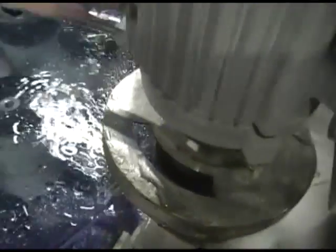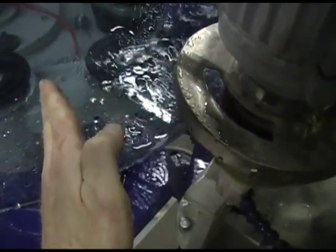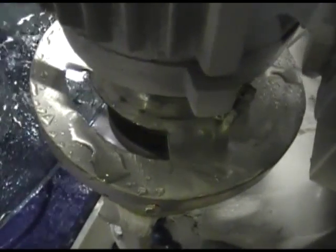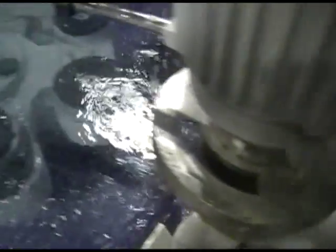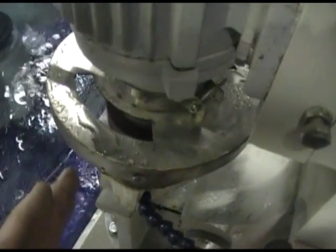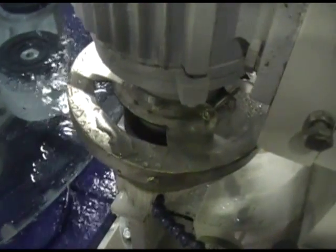Now, the head should be 90 degrees — it should always be grinding and polishing 90 degrees to the edge. You can see we're polishing right now. And if this is centered properly, the pressure will remain even. If it's not centered, the cylinder will be pushed out and pulled in a bit depending on the air pressure and the position of the glass.